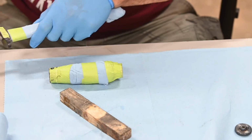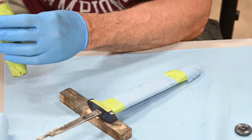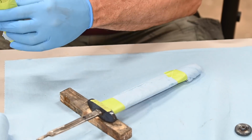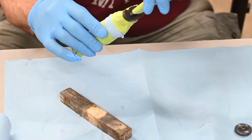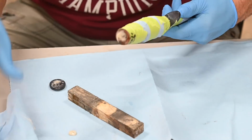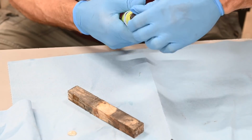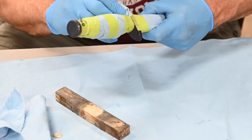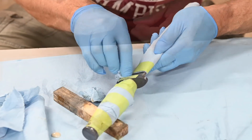Because this assembly is complex, you don't want to use a really fast curing epoxy. Now, as the pommel is screwed down, it appears to have created a little hydraulic pressure inside the handle, which caused epoxy to squeeze out. Slow curing epoxy, in turn, leaves plenty of time for that squeeze out to just keep flowing and oozing. So, I spent a fair amount of time cleaning all the joints as the epoxy started to harden up. If I hadn't, there would have been quite a bit of epoxy caked all over the knife. But eventually we're done, and the epoxy is left to cure overnight.